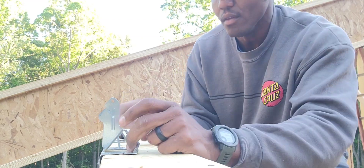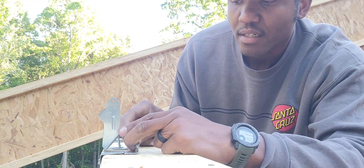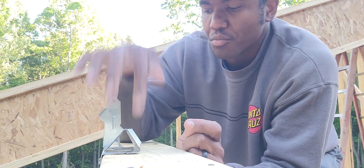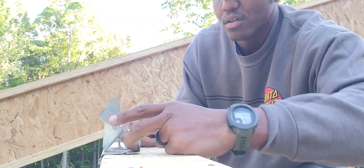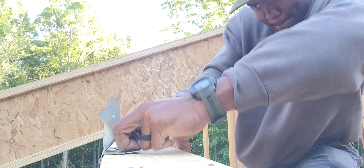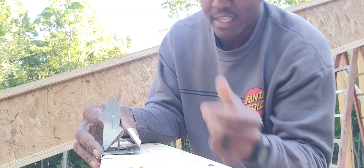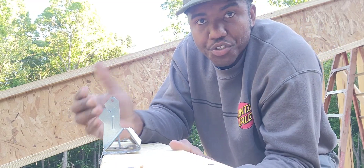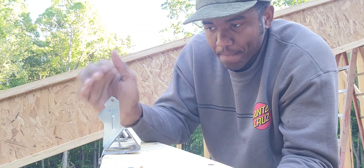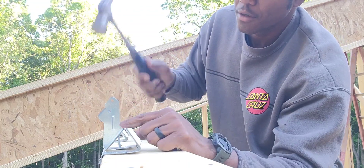Now what I'm going to do is take it in a little bit — see how A sits on B, you don't want that. Let's go ahead and spine it out just a little bit. It's okay to bend it, because with your I-joist you're using the I-joist to pound this down to the correct pitch, so that's okay.